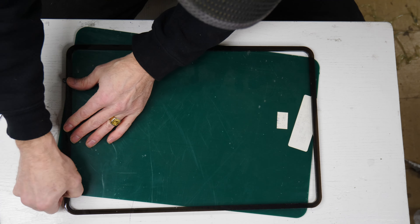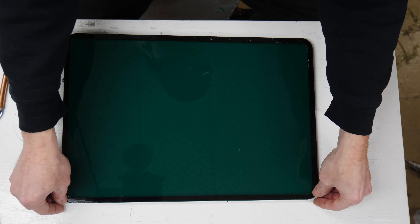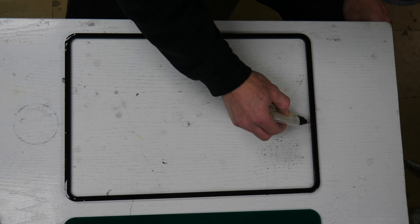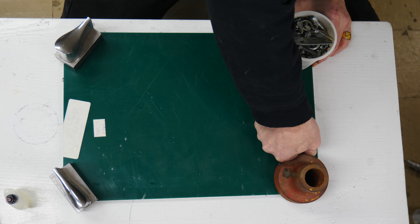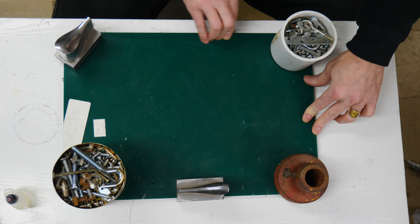It's time to assemble the parts — you can see the three pieces right there and how they go together. Acrylic usually comes with some sort of protective coating on it to protect the surface so it doesn't get scratched, and I do want this mat to be shiny. I'm putting on some acrylic cement — cement is almost not the right word, it is a solvent; it melts the acrylic and bonds the two pieces together really well. You don't want to use super glue here; you want to use an acrylic solvent to bond your stuff.